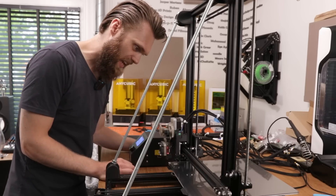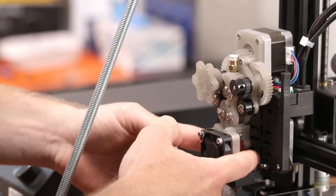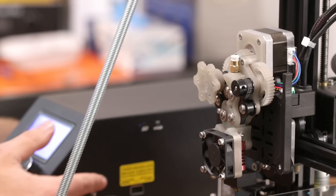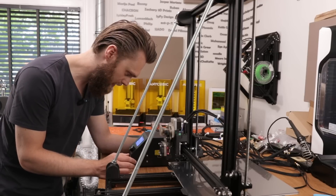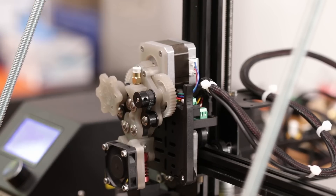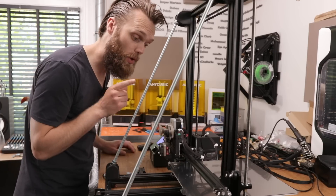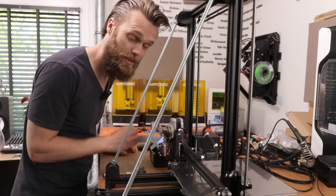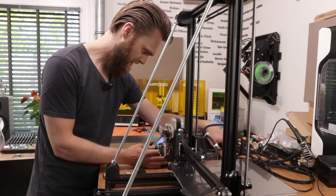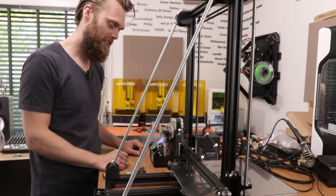I've connected everything and it looks pretty good. There's one issue - there is some movement here, so I think I have to adjust this bracket so it can also be mounted at the lower point on this plate. I've turned on the machine and it shows the right temperature. The hotend fan and part cooling fan are swapped - now this fan is running constantly. Hopefully it extrudes and doesn't blow up the mainboard. I had to reverse the motor direction - of course it was reversed. Over 10 millimeters and it extrudes, but in the wrong direction. I can just swap out all the wires - it's standard procedure. Then I only have to modify the extruder steps and we should be able to print with it.